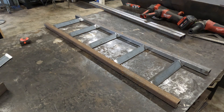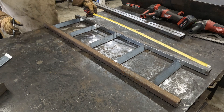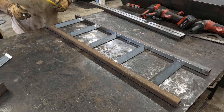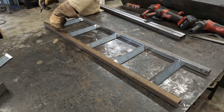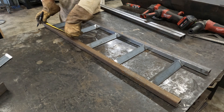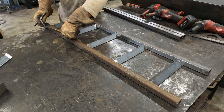I've got these all laid out here, spaced out — what I think looks good. I'm going to go through and mark each outer piece. Just 44 and three-quarters. I'm just going to eyeball it here. First one's going to be 3 inches off the back, and then every 10 inches, I guess.